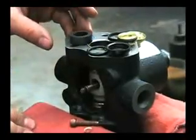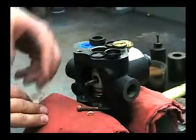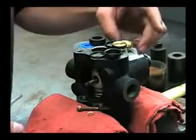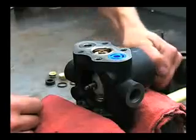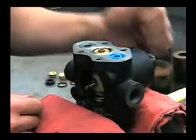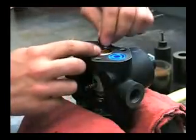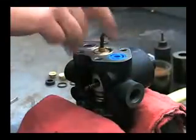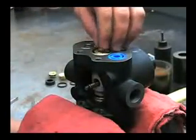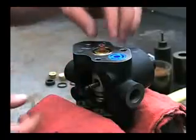You want to inspect all of those parts for wear or damage. Next, we can flip it over and take apart the other side. Before you take apart the other side, make sure you remember to turn that keyway back straight up so you don't break this fitting off. Both the top and bottom are the same as far as the seals and the part stack. Notice that the valves are actually opposite from the other side — we'll get into that a little later.